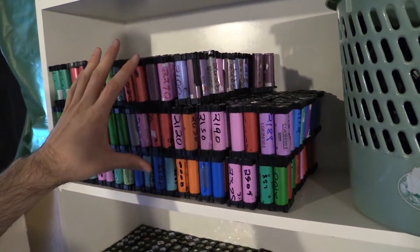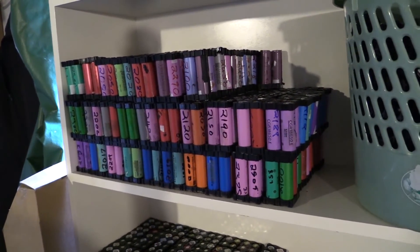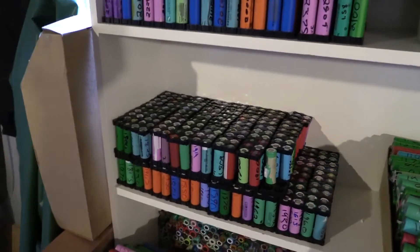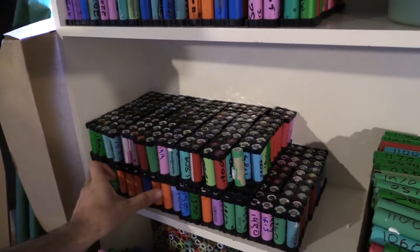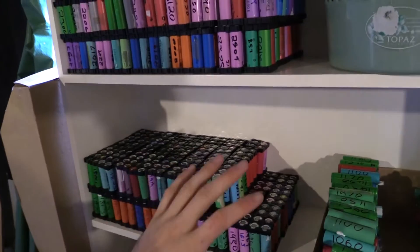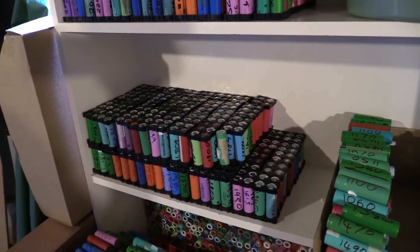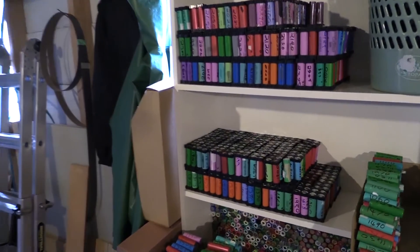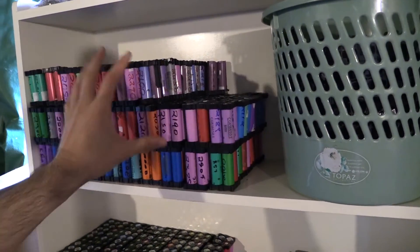This first pack of 5 kilowatt hours will be full of really good cells. I would have liked to get more than 600 of these, but a lot have come down to the next bracket: 1800 to just under 2000mAh. So I've started making a second lot of packs. These will be in their own bank — the 1800s all the way up to 1920s and 1980s. They're really good, pretty much not much different to the ones above, and could potentially be in the same bank. But I'd rather get to 600 here and 5 kilowatt hours first.